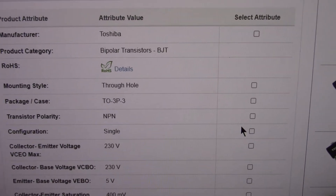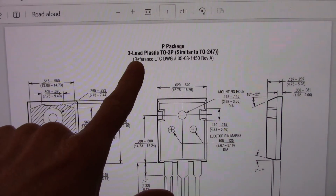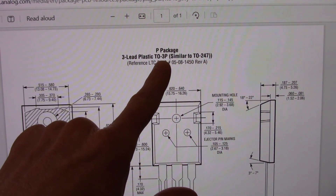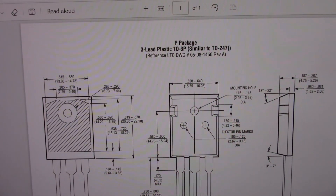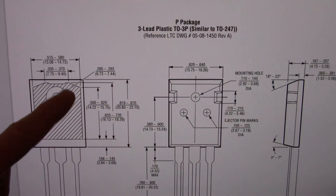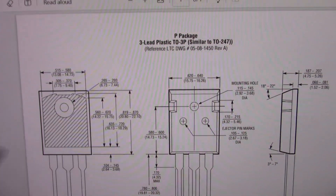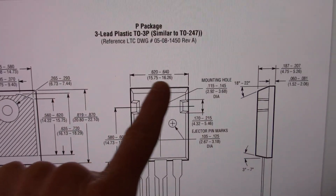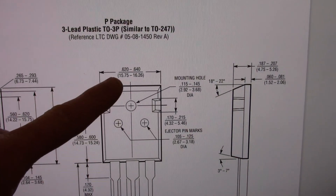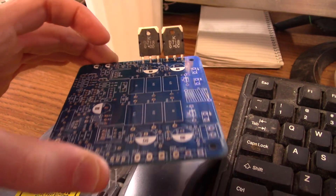So what is going on here? I did some searching online and came up with this: it's the TO-3P, similar to the TO247, and it looks like those larger transistors. However, if you look at the dimensions, they are more the size of these TO3Ps. The TO264 transistors are about 20 millimeters wide by 26, and you can see these are smaller. These would fit, but those larger transistors would clash on the board — so I can't use those.